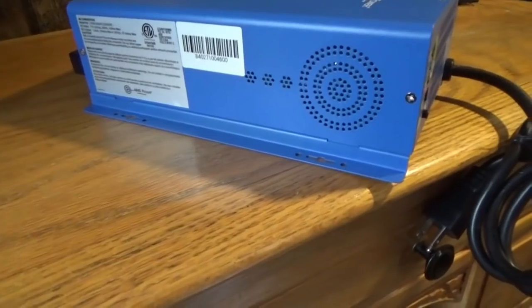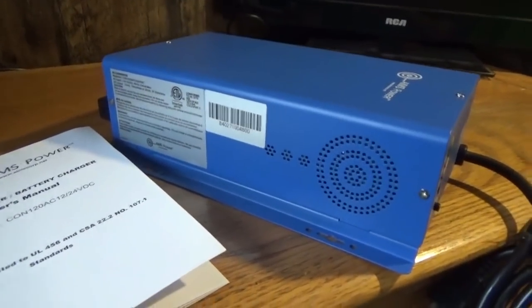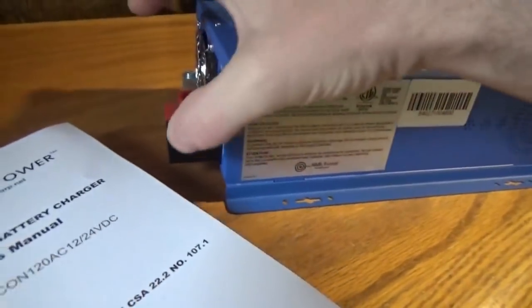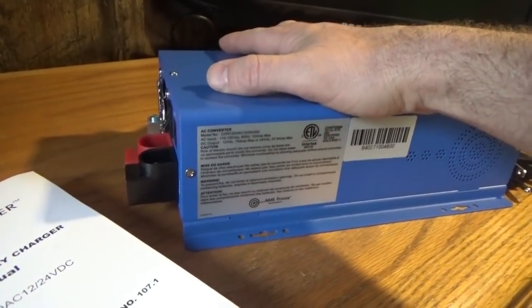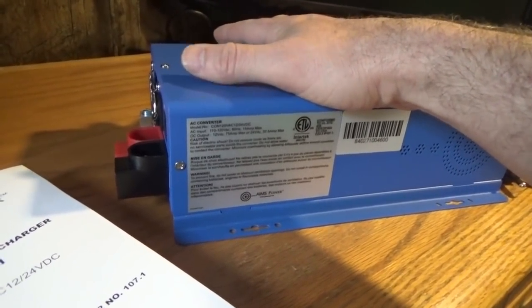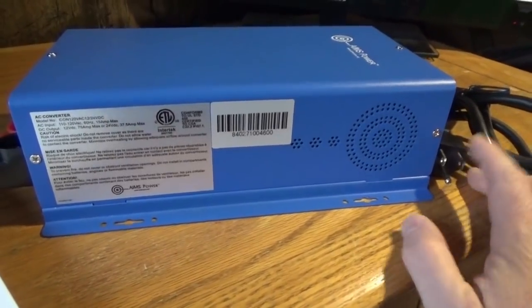I can't wait to get this out there. I'm going to have to get myself some wires and get this in a protective box. We'll be back when I get some time for this. I'm going to go over all the paperwork and consider my installation and where it's going to go on my off-grid battery bank for best results. We've got here an AC power cord that needs to be plugged into grid power, and it's got to be close to the battery bank because the 24-volt DC outputs are going to need really thick cables. I'm probably going to mount this right on the outside of the battery box along with my solar power charge controller in their own isolated box. I'll get myself some cables, get a fuse to go in between, and I'm also going to need a long extension cord to go from the house to the charger.